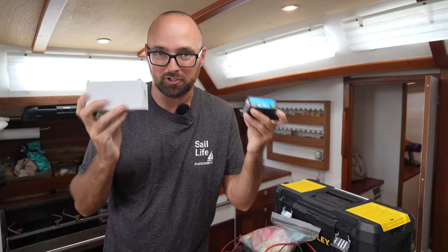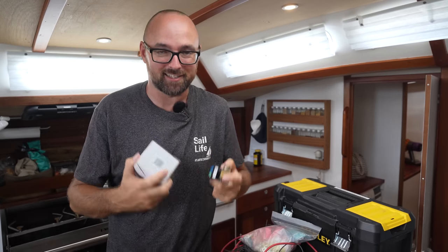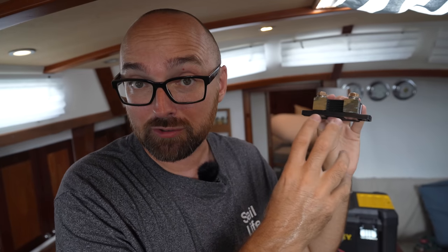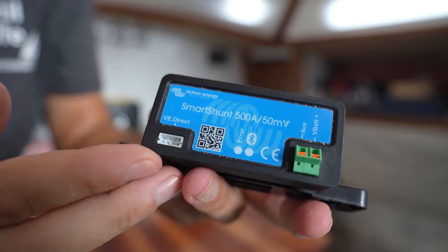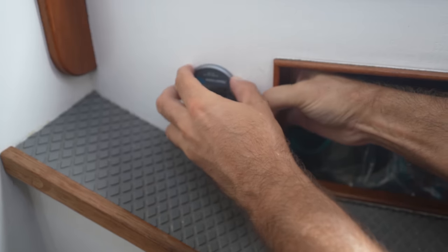Here I've got a couple of Victron smart shunts. A shunt will allow you to measure current in real time, and if you want to track energy consumption that is exactly what you want. Shunts work by creating a voltage drop across a known value resistor when current is flowing through it; that voltage drop can then be used to calculate how much current is flowing through the shunt. Victron calls these smart shunts — normally a shunt is pretty dumb and can't really communicate with anything, but these have both built-in Bluetooth and what's called VE Direct. VE Direct is a Victron energy standard used for getting devices to communicate together. In our case, our MPPT chargers communicate to our Cerbo using VE Direct. I'm not the biggest fan of VE Direct — not because it doesn't work, it works great — it's just that the connector they've chosen is probably the flimsiest connector in the world and it's just not retained very well.